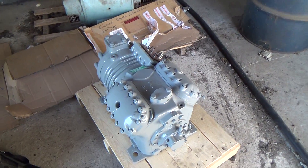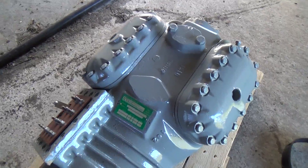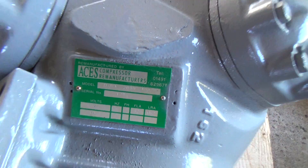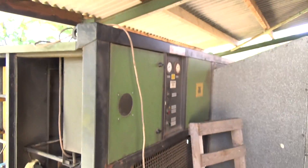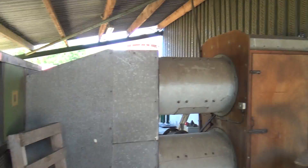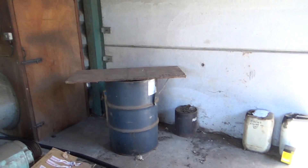Back out, changing this big 20hp Copeland — this is a rebuilt one. We've got to get all the gas out of this machine, which is a big dehumidifier. It blows dry air through there, and that goes through a perforated floor in the barn, and they dry herbs.